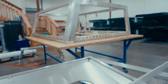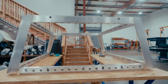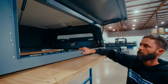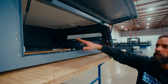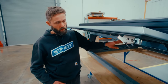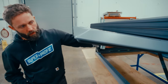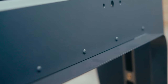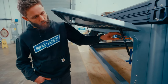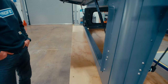When we were designing the fuselage itself, we were really thinking of it as a commercial grade canopy, and a huge design criterion that we were working around was keeping full opening at the sides of your truck bed. So we designed all the strength into the fuselage and avoided having to do any kind of braces that would kind of choke out your pass-through. Being in the Northwest, we were thinking a lot about water flow and camping in the rain. And as we were looking at these big old openings, we thought we ought to add a provision to make sure water didn't just flow down into them. So we added this gunnel. It diverts your water coming off the back of the door down and around so it exits to the sides of the opening and not just into it.